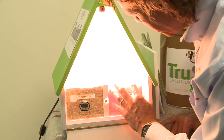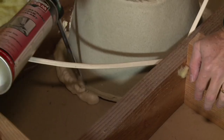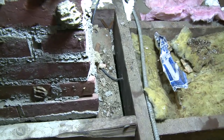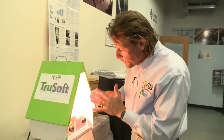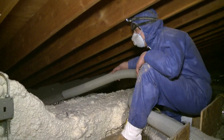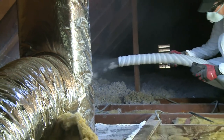If you have fiberglass batts in your attic, we will move them to air-seal the attic floor and to cover your can lights, attic hatch, around your chimney, and all the places where air can get from your house up into that vented attic. Then we will put those batts back and blow cellulose insulation over the fiberglass batts to cap it off.